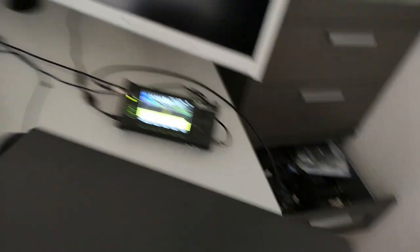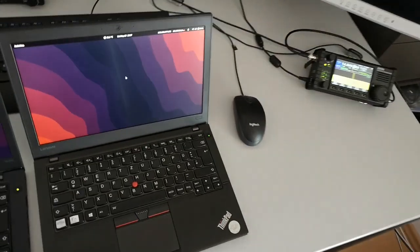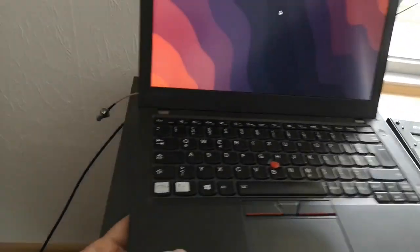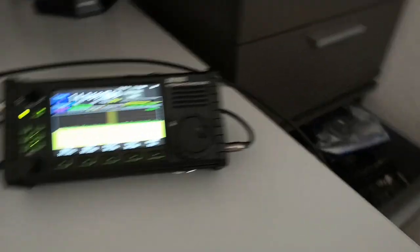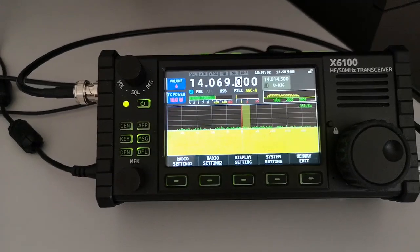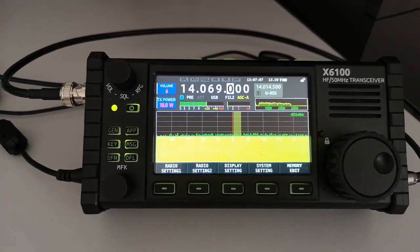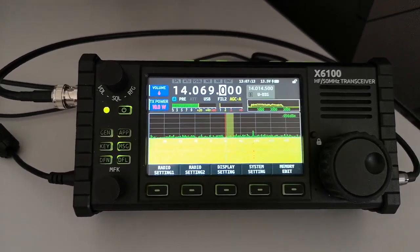So that's my Lenovo V130. Let's put that to one side and try the other laptops. This is the X260, which is far more solidly built — it doesn't bend when you pick it up. Putting it in front of the antenna, there's very little extra noise being generated. And if I touch the trackpad, there's a little something popping up. I can hear it more than see it — that little peak that's popping up and down is coming from this laptop.